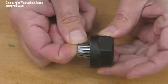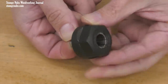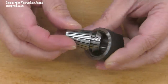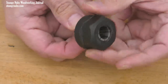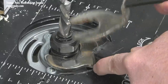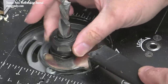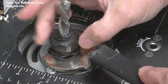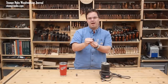It's difficult to see on camera, but perhaps you can notice how I can move the collet in and out of the nut just a little bit. You can see it a little better from the top side. This movement is due to the slot at the top of the collet being a little bit larger than the ring inside the nut where it locks in place. This movement is necessary so the nut will spin freely, but it's also what causes that two-step bit removal process. The first step breaks the nut free from the threads on the router. Then the first couple of turns will be loose as the nut takes up that slack inside the slot. But the collet itself is still jammed down in the tapered hole, so when the slack is gone, the nut will feel tight again as it begins pulling the collet upward and out of the hole.